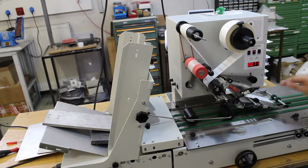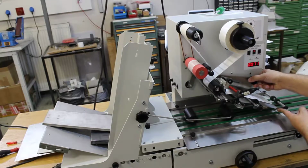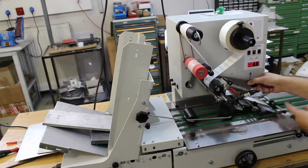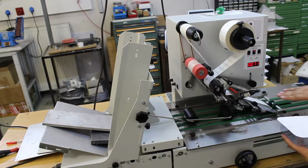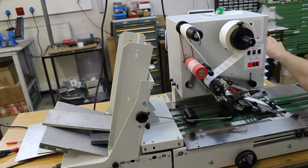That's also quite fine. Then when you readjust the labeling part, make sure when you go down that the two rubber rolls here actually meet the conveyor belt, okay? Because these have to press down the label onto the product. Of course, the measures are different when you later use these boxes. Of course, you can't go all the way down. You have to figure it out so you're around the height of 4 centimeters. But we also have to apply a different type of rolls here. But it's very simple to replace them, okay?